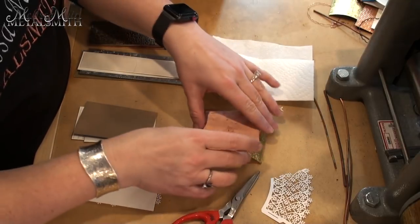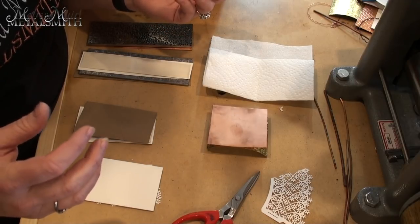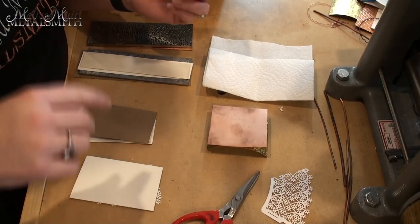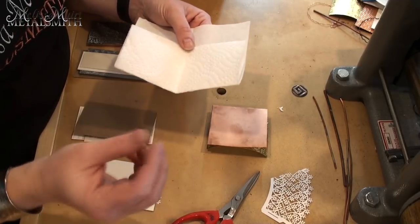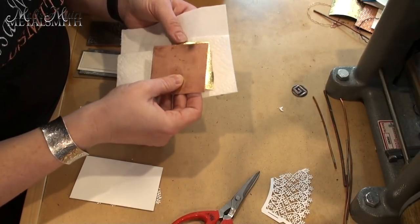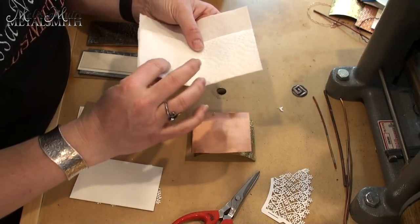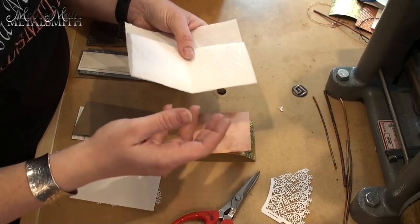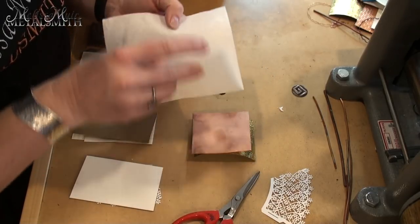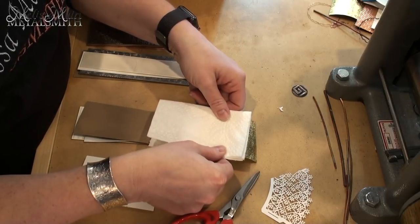I have a piece of copper I'm going to roll through with this. If you've seen my other videos on the rolling mill — I'll list links in the description and you can click the eye icon in the upper right corner. When I first started using the rolling mill I would roll my item up in a stack of paper towels — six layers, three on top and three on bottom. I don't do that as much anymore, but I want to show you that you still can. I've folded this paper towel so I have three layers; fold in half and I've got my six.